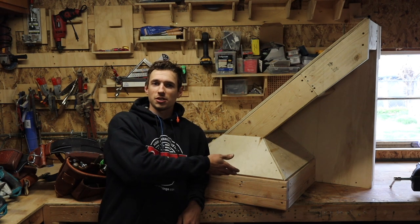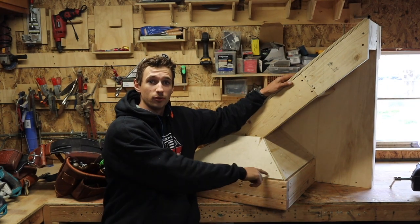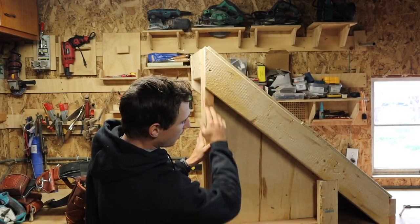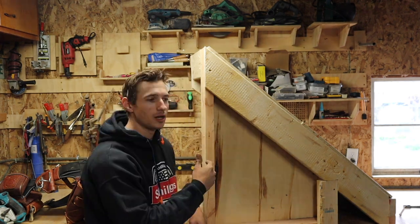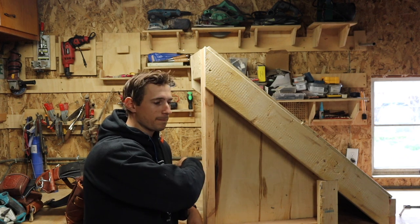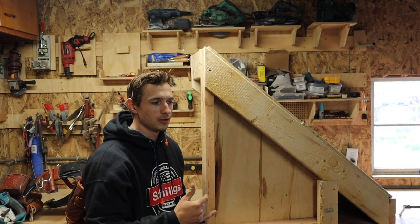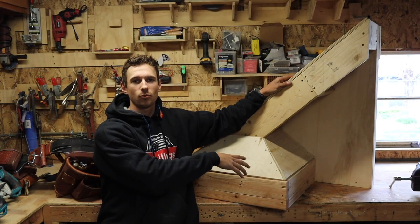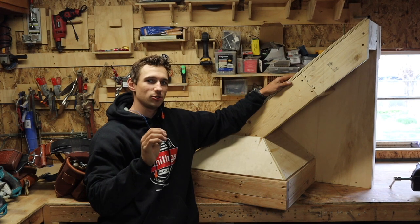I always love building models and I built this one six months ago. This is a 10-12 gable end with a 10-12 hip return on it. I've got my gable wall and my rafter. Today I'm going to do something very similar — a wall that the rafters sit on, practicing my hips, overhangs, rafters, and fascia heights. How all this stuff works and comes together was super beneficial to me and I always wanted to do more.